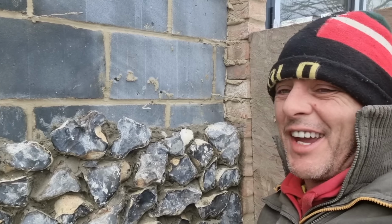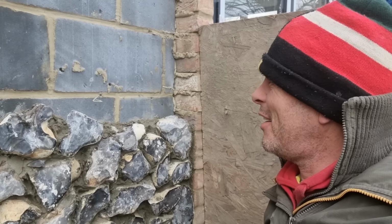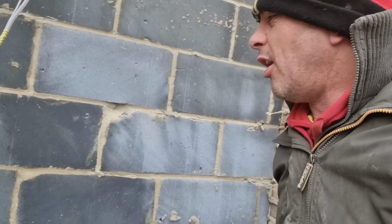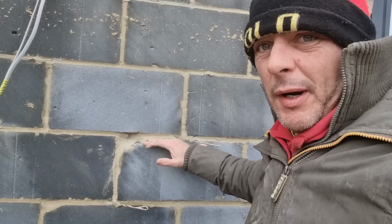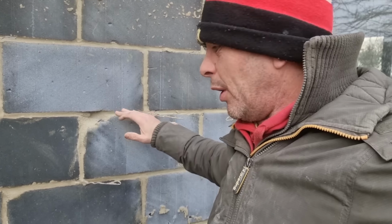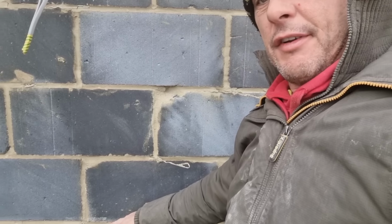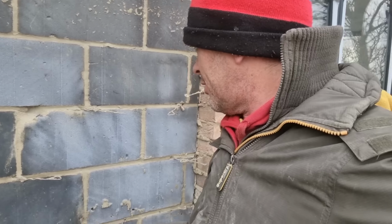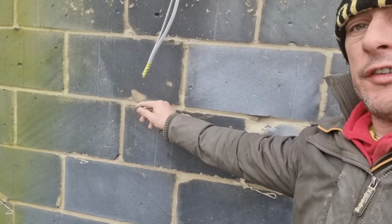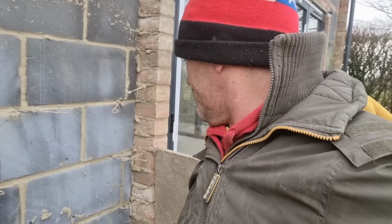So now I'm just gonna continue stacking up some more. I don't think I'll be going too high with it this side. Don't want to go too mega high. If I could get halfway up at a time, it'll be nice. But if it starts to pull out, I'm not going to risk it. I'll probably just get over this next wall tie. We'll just have to see gradually. Plenty of wall ties in there. There's ties every course. So it's only like laying three bricks and then we're tied again. So as long as we can keep it balanced that long, we're happy days.